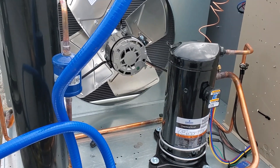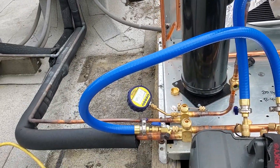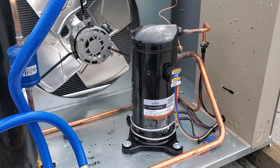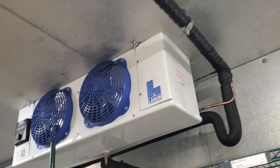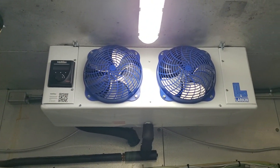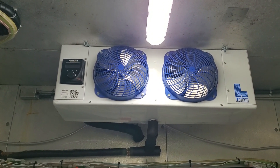I've pretty much peeled off most of my guys — sent two of them home already. Still have two here left with me, but I'm going to be peeling them off too, because essentially we're just doing a vacuum and hoping nothing bad happens. Here's our evaporator for one side where we used the existing line set — it's already going in. We're just utilizing what we had. We had to run a comm line up there. Here's our other coil. We haven't turned it on yet because we're still evacuating. Once we get it evacuated, we'll turn it on, do the programming, and hope there's no problems.